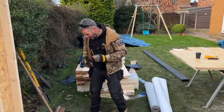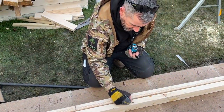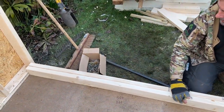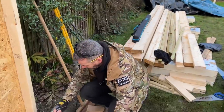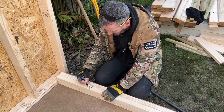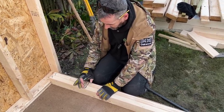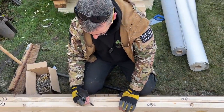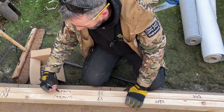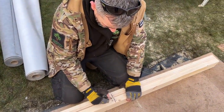That's my base plate and that's my head. I'll write 'base' and 'head' on them for clarity. I'm right on my length. I'm going to mark that — both timbers are butted up so the mark is the same — that will be the edge of my window, so I want a timber there. That's the critical part. This one over here the same — that's where the timber will go, creating the window opening. My TV goes there and we're all good — that's my window, and that's also my window.